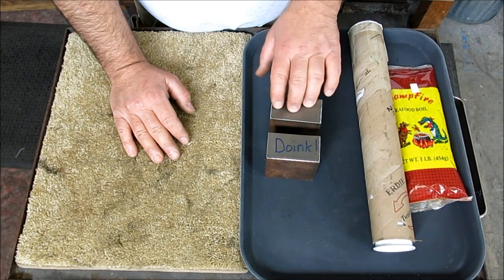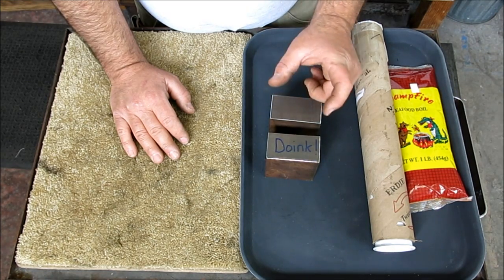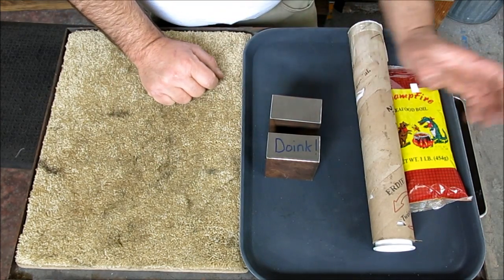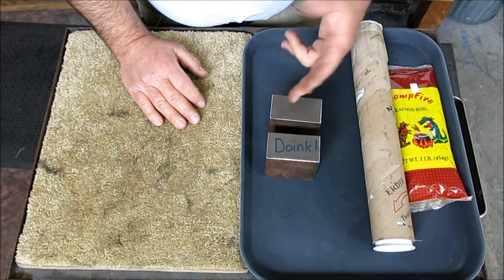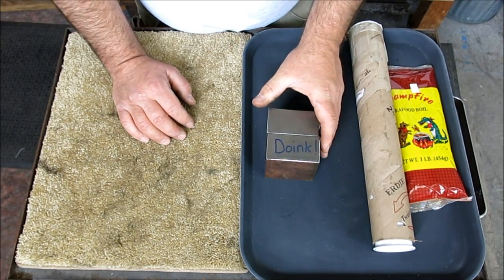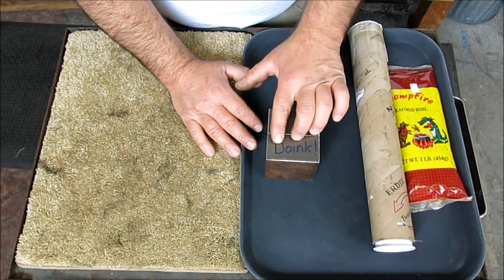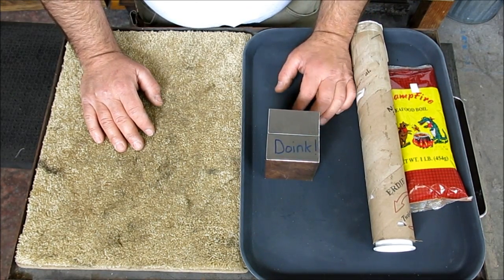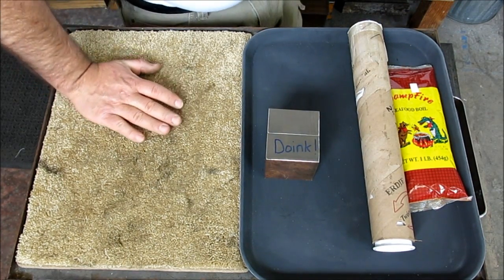So if you want to make a wheel dressing thing with a diamond, a cast iron base is real nice because you can release it, boom, and it comes free and it's smooth and it doesn't drag coming off. Or if you want to make appliances that will be around magnets. Anyway, oh, look at that, man. I should get my micrometer out and measure those because they're just right there. Those are going to become some little 1-2-3 blocks for the welding table. All right, and I think that's it.